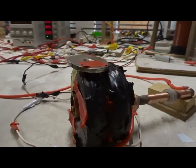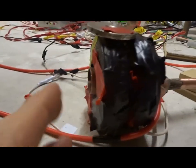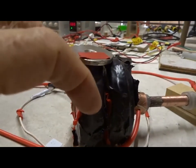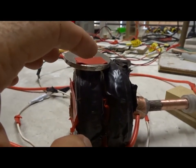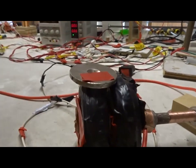So long as that small copper tube, which lies inside the big one, is located in this half of the device, that radial magnetic field will make the argon ions — as they spin around — curve around and shoot out away from the device. Curve anticlockwise. And that gives you an ejection force, which you wouldn't have by axial field alone.